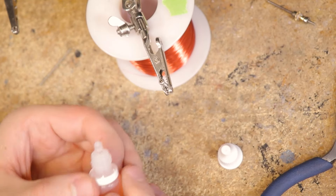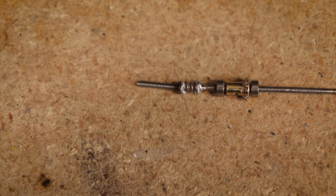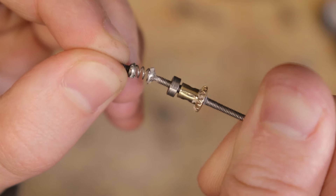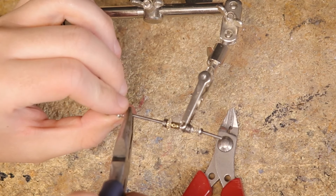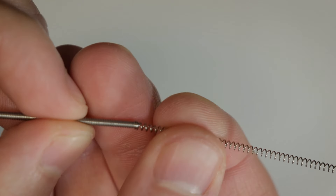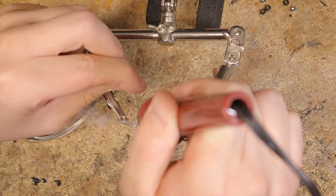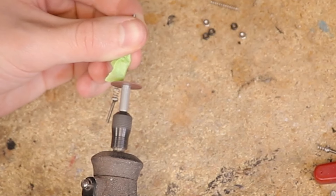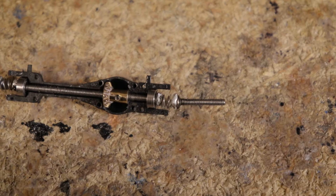The process was pretty simple. I just dropped some flux onto the surface and melted the solder with the same iron I'd use for electronics, and although not very pretty, it did provide a solid connection. Something that made soldering these springs onto the threaded axles a bit more difficult was the fact that the inner diameter of the springs is larger than that of the axle. I've since ordered some smaller diameter springs that fit tightly around the threaded axles, which should help make this process easier. Regardless, I was able to get a nice strong bond, and although some Dremel action was required to ensure the bearings could slide far enough so the assembly would fit back in the housing, it all feels solid.